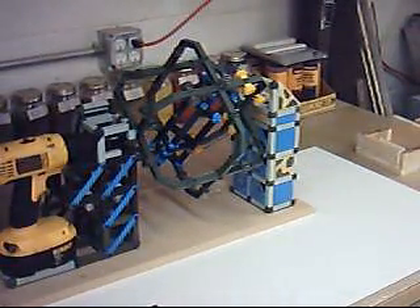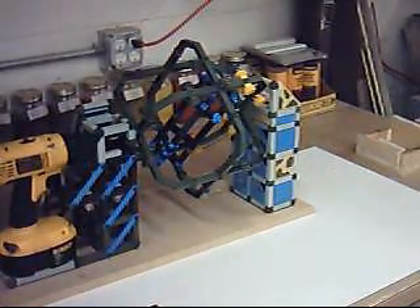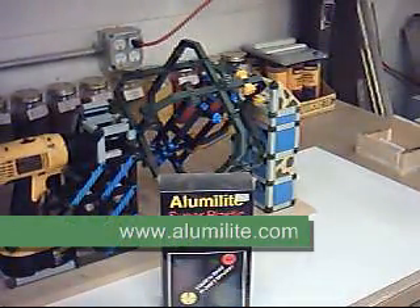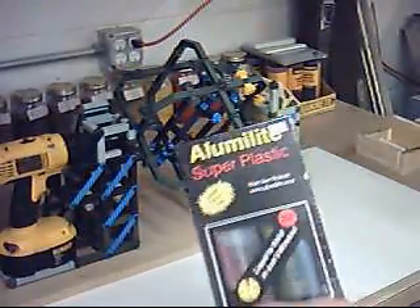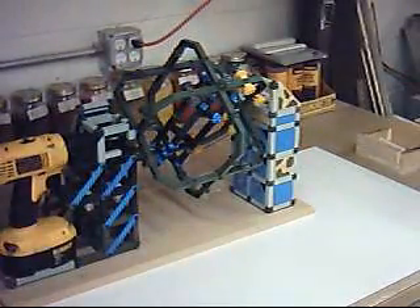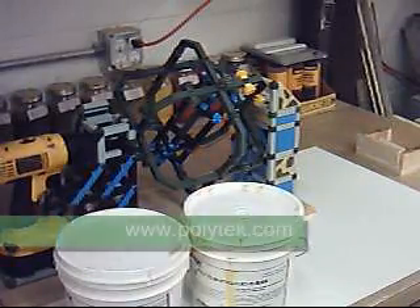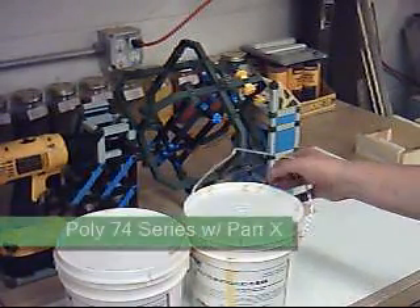The other stuff that you'll need is casting material. I have several options for this. One of them is really expensive. I actually really like Lino-Lite — you can find it online at various places, and a lot of train and hobby shops will sell it. It's really fast-setting, which is nice for rotational molding, and it sets a really nice, consistent plastic. Other options — this is what I'm using right now — the two-part polyurethane liquid rubber that I get from Polytech.com. It's really affordable.